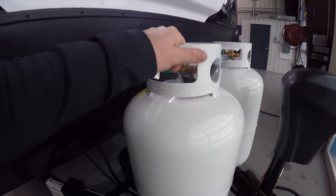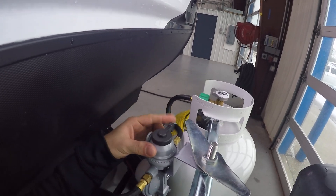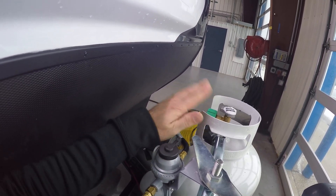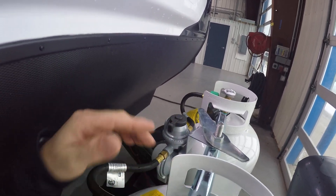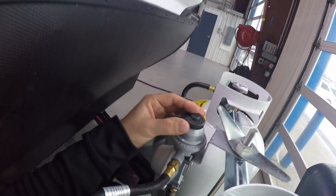You're going to have two 30-pound LP tanks, both full. The regulator is going to be right in the middle here. You have a little black knob that's going to show you what tank you're using — point it this way to use one tank, point it the other way to use the other. On the back side there will be a little gauge: if it's red that tank is empty, if it's green the tank is full.